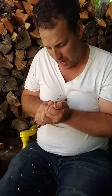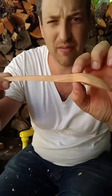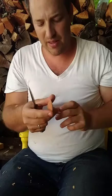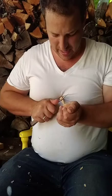Now I'm going to redo the line on the back, and here's a chance to adjust the height of the keel based on how thick I was able to maintain this. And depending on what sort of cross section I want in the spoon, it doesn't always pay to make this super thin because then you can't do interesting chamfers. I'm more concerned with what the line looks like when I look at it from the side, and whether I like that line.